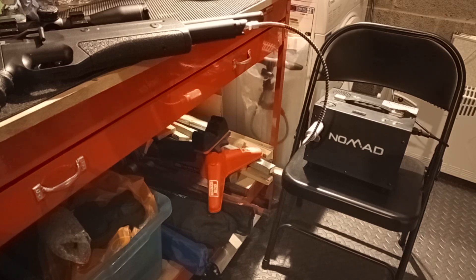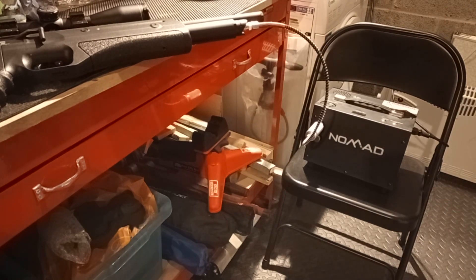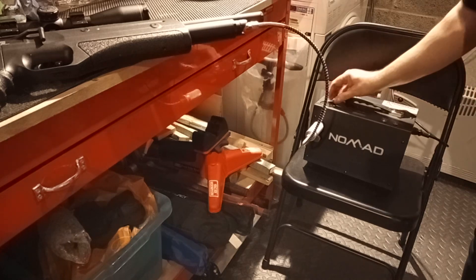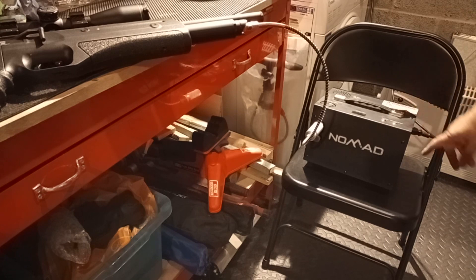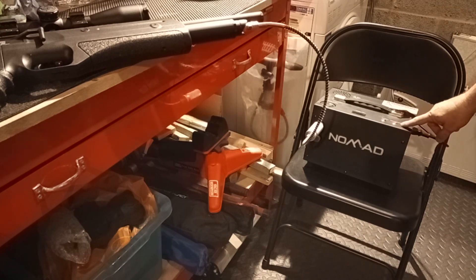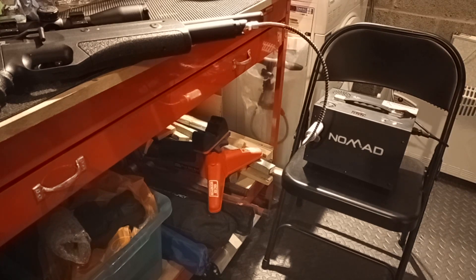It's at about 120 bar. You can actually fill the Reximex to 250 bar, but I generally only fill it to just over 200 - about 210 or 220. So I've set my gauge to just over 200. Now I'm going to switch on. You've got two switches on the Nomad: a power switch, which puts the main fan on - you'll hear it kick in - and then when you press the second button it turns the compressor pump on, which is what I'm going to do now.